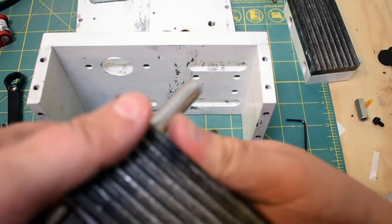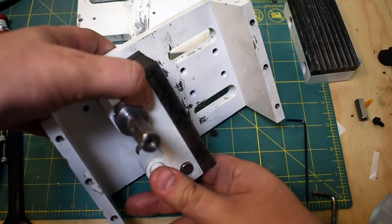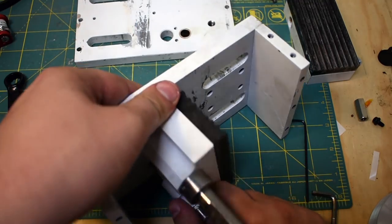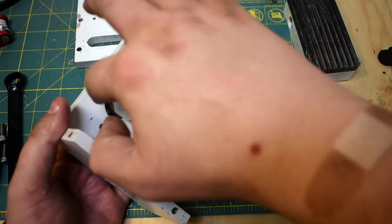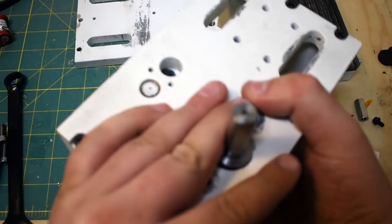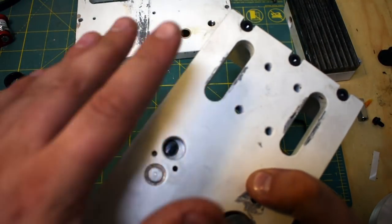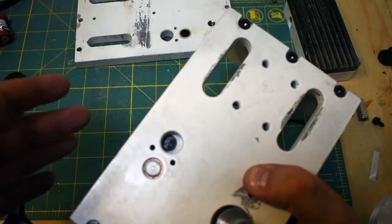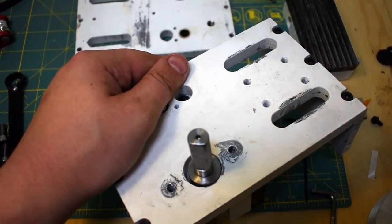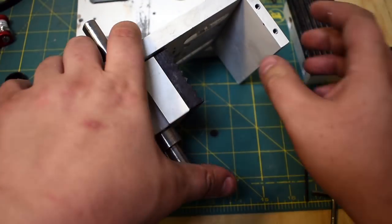You've actually got to put the moving jaw in before you put the whole housing together. I did leave myself a bit of room to assemble it from the side. So, strictly speaking, this hole is large enough to push the two sides of the crankshaft through. And I've got an access hole on this side, and that is enough to install the rocker pin. I didn't end up doing that. No particular reason there. I mean, tool access isn't amazing, so I probably could have drilled some holes up here for the set screws or something, but it's just easier to do it this way.